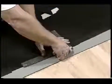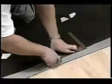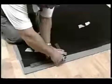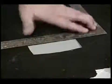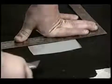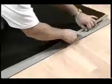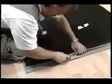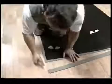Align the inside edge of the straight edge with the lines scribed on the template. Then scribe the outside edge on the bulletin board material and continue following the template around the entire piece. Be sure to remember any of the other obstacles also traced, such as plug points, switch boxes, etc. Once you have the entire piece scribed out using your utility knife, retrace the scribe with the hook knife to make your final cut.